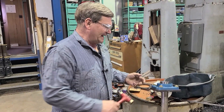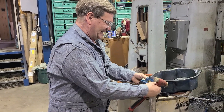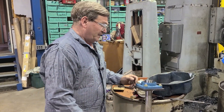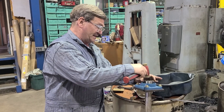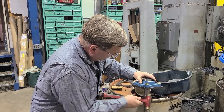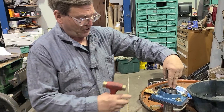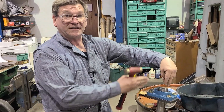What I was talking about with lining up is that this bearing itself aligns, but it takes a little bit of movement to align it. There's a little bit of movement in the bearing beyond what it takes to move it, so you actually have to move it a little further than just pulling it to get it to loosen up. After you have your bar in here and it doesn't want to slide, just take and tap — just with the bar in there, tap around it. Let's say the bar is to this side — the bearing would need to move this way to match the bar.